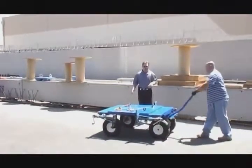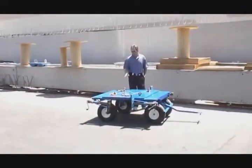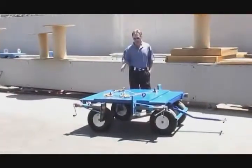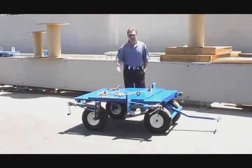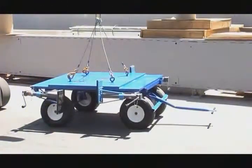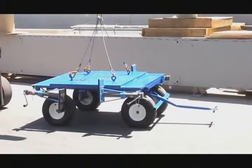It's a portable trailer that can be wheeled around on decking, metal, or concrete. It's good anchorage for two people and we'll demonstrate some of the ways to set it up and how it can be used. As you can see, this can be hoisted up on the building or on a freight elevator. It weighs approximately 2,000 pounds.